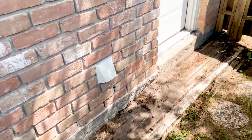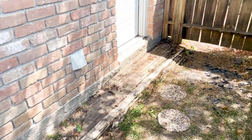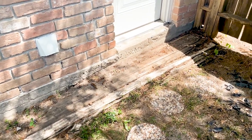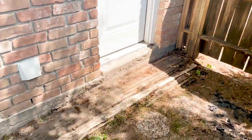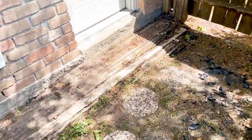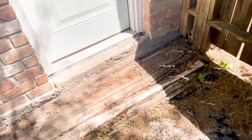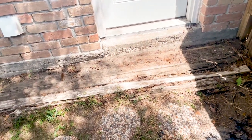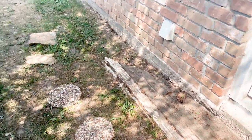We write this up often. We are also WDI-certified — wood-destroying insect-certified by the TDA. Right here we have wood within the drip-edge of the property, which invites termites to the structure. We have rotting wood right next to the property. We dug around and did not find any termites, but we'll recommend to remove it. If you do not want to remove this for whatever reason, you have to treat this area to help prevent termites from reaching your structure.